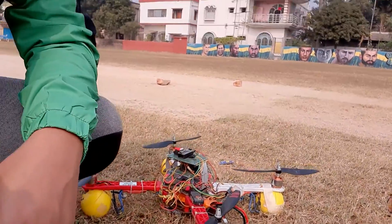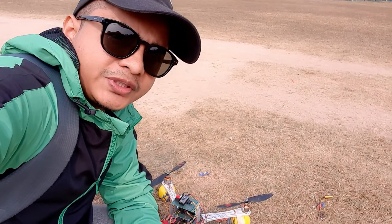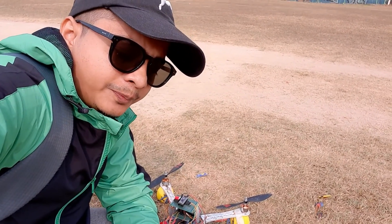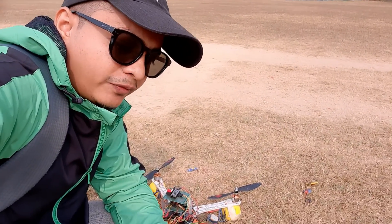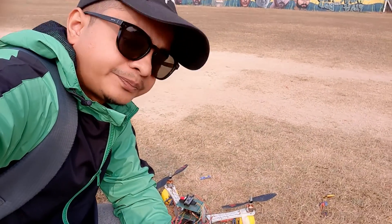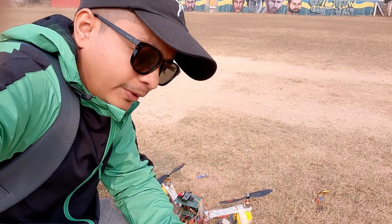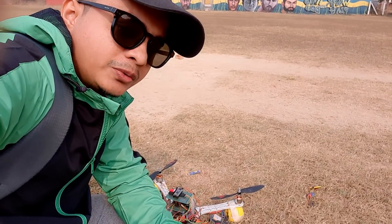This is the drone. The main point of today's test will be to check whether my GPS controller or the PID controller will be able to position the drone to its home location or whatever location I have set. I want my PID controller to kick in as soon as I switch on my altitude hold mode, so on switching on the PID control the GPS hold should make corrections to the pitch and roll.